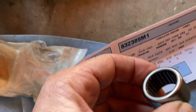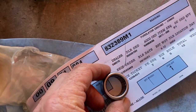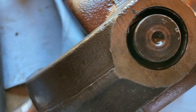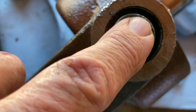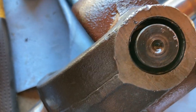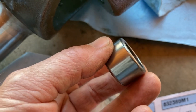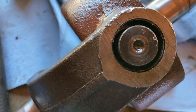Here's our new bearing. Look inside — you can see it's a needle bearing. It's just like a cup off a U-joint off a drive shaft, except it doesn't have a top — it's open all the way through. It's dinged on the outside here but the inside is in good shape. I have a feeling that what I'm seeing on the inside is the tin part of the old bearing still in there, so that's going to have to come out before I can press this new one in.